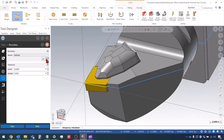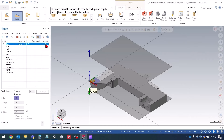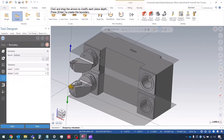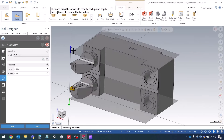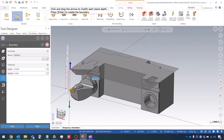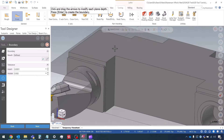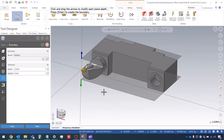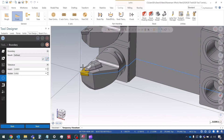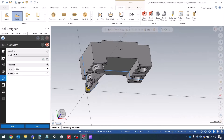I'm going to click on the Adjust button. It looks like I have a section view enabled, so I'll disable that. Here we can see what Mastercam is looking at for the boundary — everything between these two planes is being taken as the boundary. I'm going to grab the upper handle and drag it down, snapping it to the midpoint right here. Now we're just looking at this portion of the holder, and I'll press Enter to confirm. Our boundary has updated — we're only looking at this insert and not the one above.